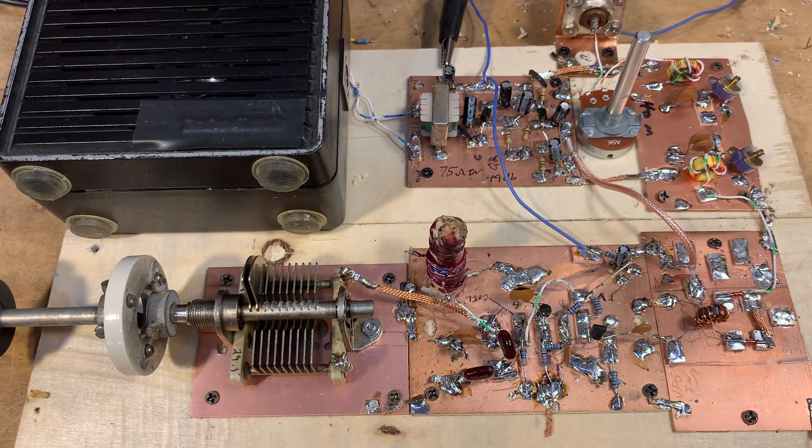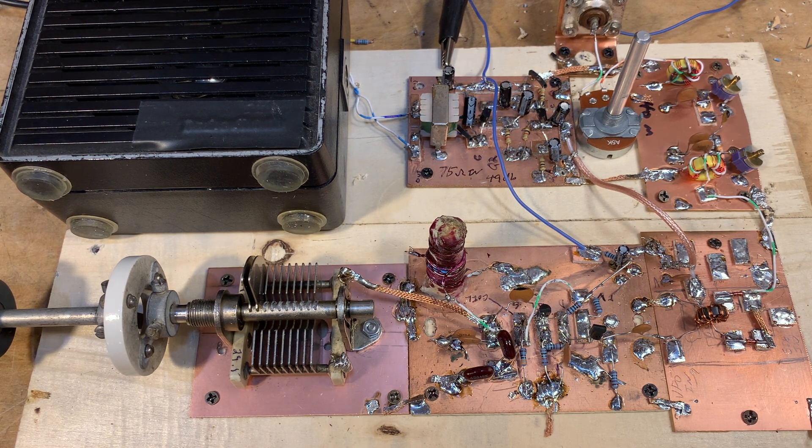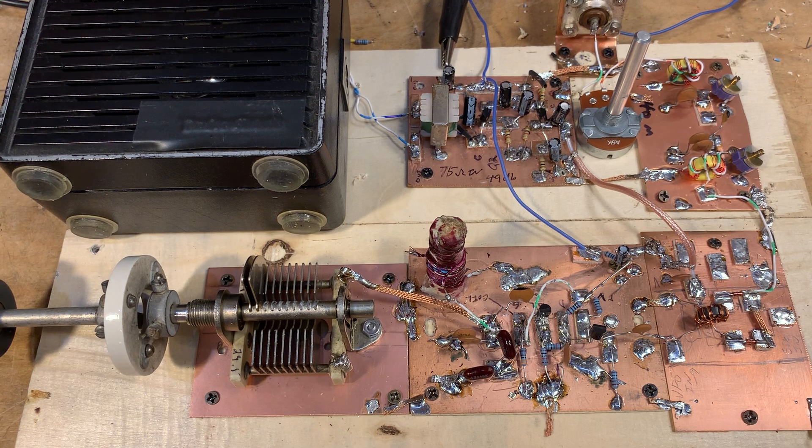I measured this thing today. At audio frequencies, the input impedance was about 75 ohms, which makes it a pretty good match from the audio output of the mixer. Then I measured the gain across this thing at 49 dB. The LM386, when you put it in high amplification mode, comes out at about 46 dB — so this is similar to what you'd get from an LM386. What I found really surprising is that the total amplification in the circuit is only 49 dB, and after losses through the mixer and bandpass filter you're probably down to about 44–45 dB. The conventional wisdom is that you need 100 dB to make a receiver work properly, but I'm finding that's not the case.